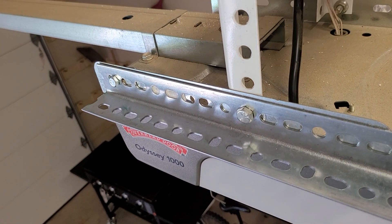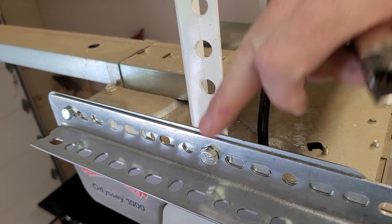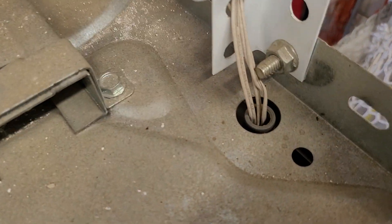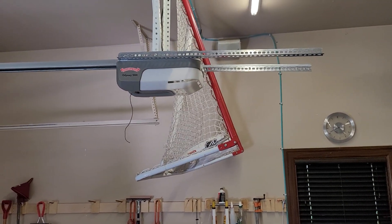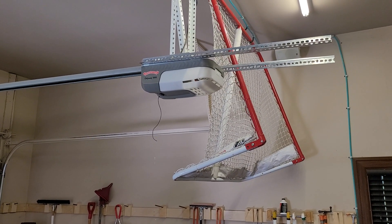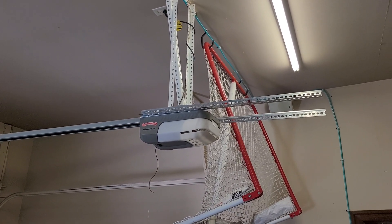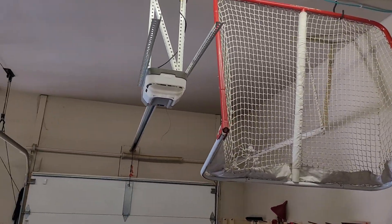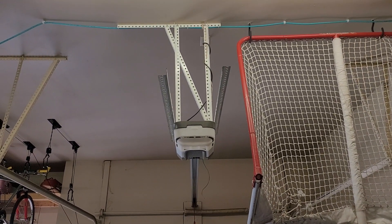Okay, that worked out well. Right now this nut and bolt is loose; this one I got tightened back down. It looks like it's going to work. I'm going to do the other side and then put this piece on. All right, those are mounted — I snugged them all up. I'd advise: don't take both bolts out of your opener at the same time. Be careful, work one at a time, and make sure you've got free hands to hold everything in place.